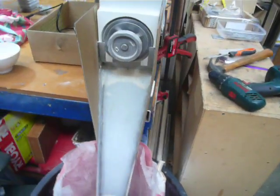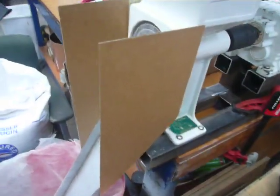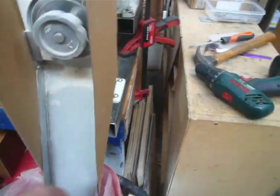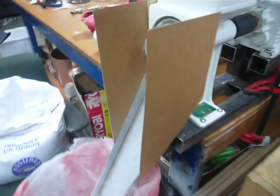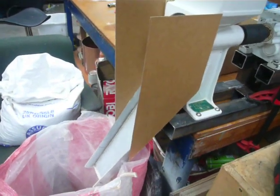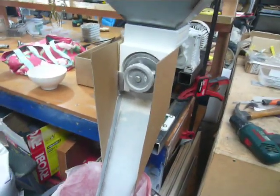If you're wondering what the cardboard flaps on here were — I noticed the last tweak I'm doing: occasionally you get little bits firing out of the mill that don't quite make the chute. I need to weld a couple more sheet steel flaps on here, but the cardboard mock-up is allowing me to work out exactly what I need before I go ahead and weld any steel. That's looking about right — nothing escapes.